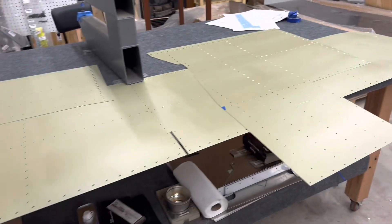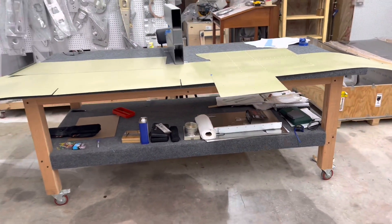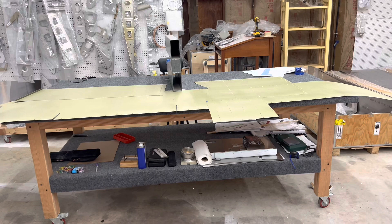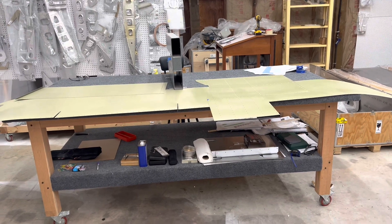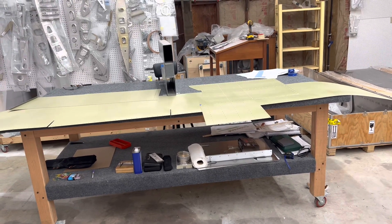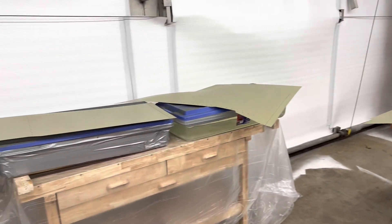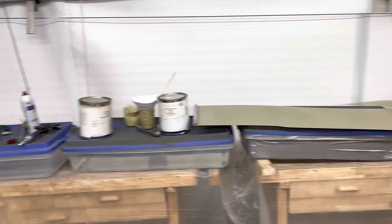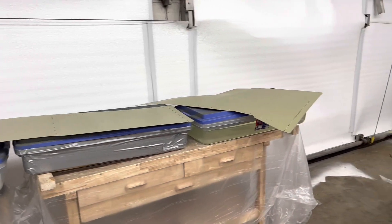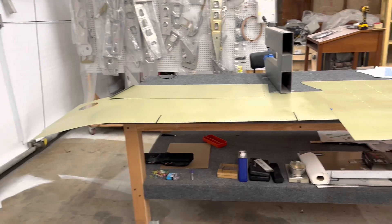To prep these appropriately, you scrub them with Simple Green and a Scotch-Brite pad, then use a chemical called Pre-Coat, which is a mild acid meant to prep the surface for better paint adhesion. Then you let them dry while you prep your paint, paint gun, airlines, and PPE equipment. All of that took about three and a half hours.